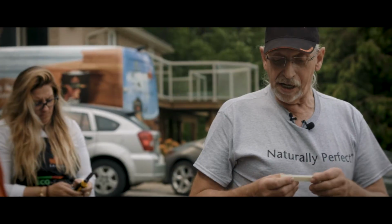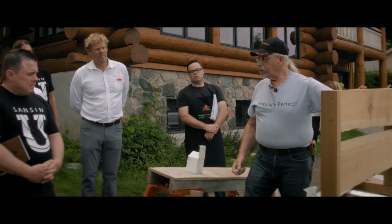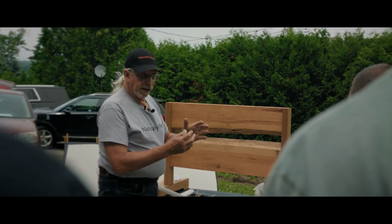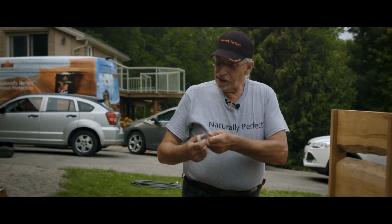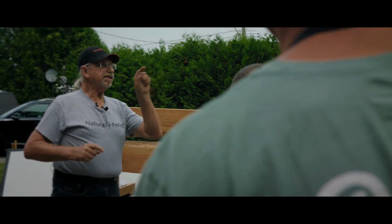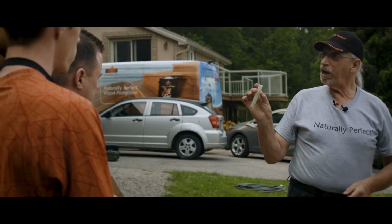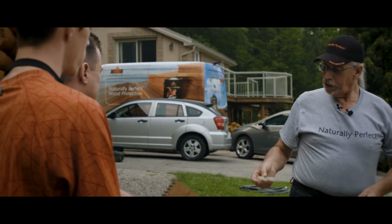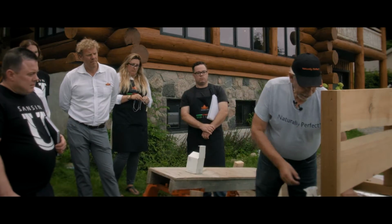As I said, you've got to cut it off. And what happens if you've got a newer log house and the logs move, where the steel staples are, it'll pull the chinking back. So you look down your house and you see all these dimples all the way along, whereas the chinking will let go of plastic. It won't adhere to it. So that's what I use in here.